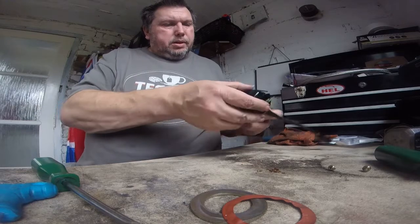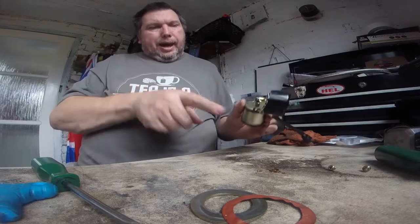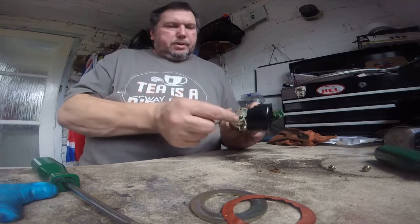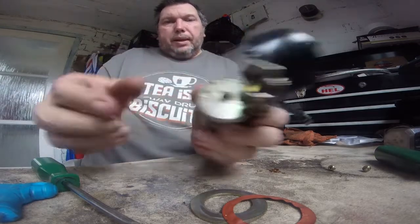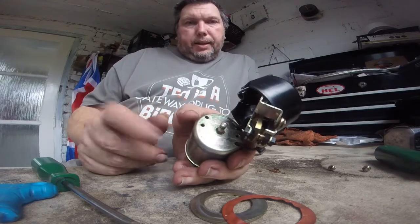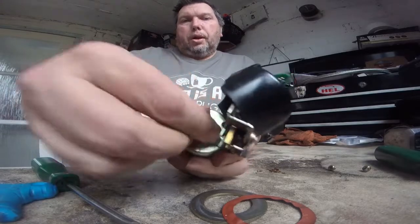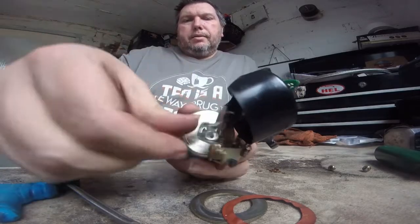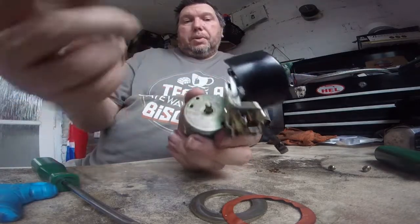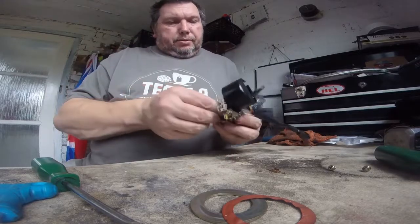Yes. Oh, yes. So, yeah, that contact, I think, would have energised. Would have worked a bit like a relay. A relay is basically a miniature electromagnet that, when it's energised, will pull or push a contact. So that's all that did. But that wasn't getting any power. Well, there's power going to this, but it wasn't going any further. So I'm guessing something on the circuit board shat itself.